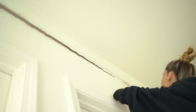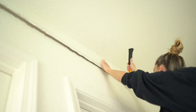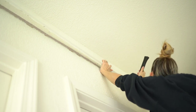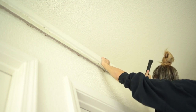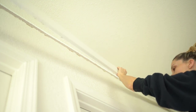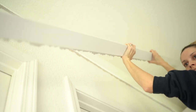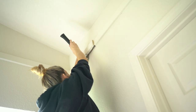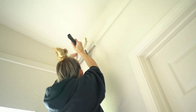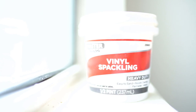So this trim had to go. With a flat head screwdriver and a hammer I was able to pry it off. The trim wrapped all the way around the room, so there were several big pieces and then some smaller pieces. After all the trim was off, there were a few raised lines left over from paint that had kind of piled up over the years, so I had to sand those off as well as fill in any nail holes with spackle and sand all that down.